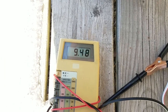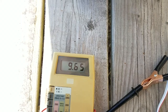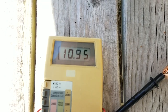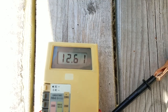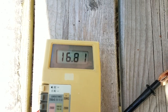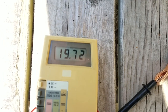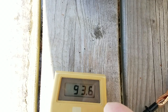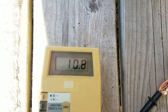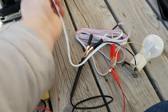I've got a multimeter on the DC output. No load yet, but you can see — like the AC output — the voltage is not regulated. It goes up and down with the speed of the engine, because of course this is a true mechanical generator, not an inverter generator. At idle it's about 8, 9, 10 volts, and close to full speed we're getting over 20 volts. So in the intended use case — charging a battery — you would want to adjust the speed to where the proper voltage is being applied.